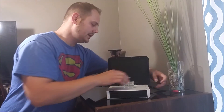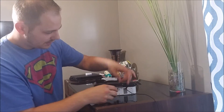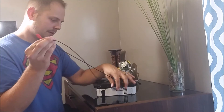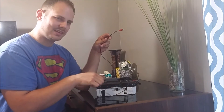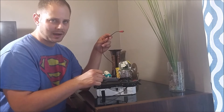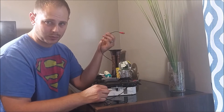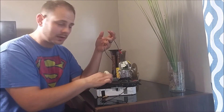Currently there are two wires coming out of the back - I'll end up shortening them since they don't need to be so long. One is for the Wii power and one is for the screen. The only downside to using this screen is that it requires 9-volt output, while the Wii is 12-volt output. Because of that, unless you use a circuit board with a resistor, you can't use the same battery or the same power cord, so that's the one downside to this screen.